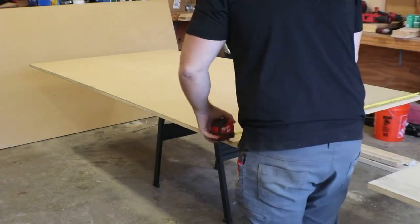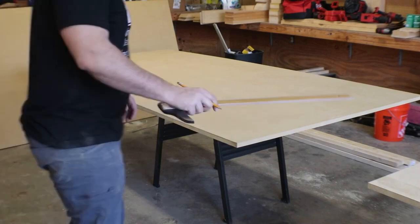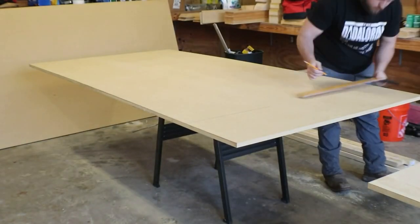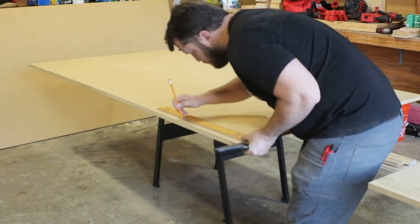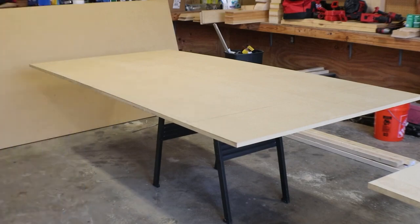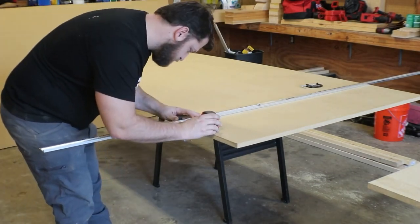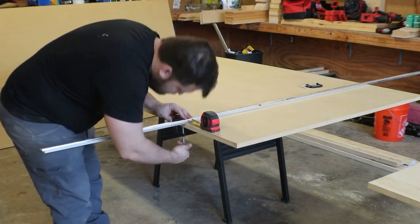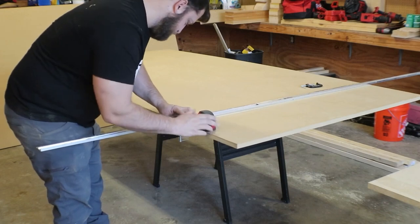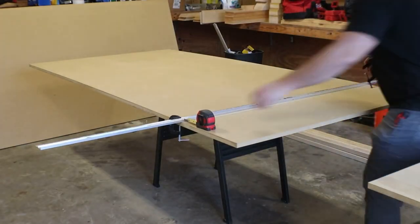Using standard Milwaukee tape measures — nothing fancy — and just tons of pencils so we can mark everything. Cutting these larger sheet goods can be difficult. We've got these pop-up DeWalt mobile workbenches — link in the description — they've been great for assembly tables and taking out to job sites. They're about a hundred bucks. As you can see here, we're strapping down that straight edge using standard C clamps to attach it to the table. It's not an actual track saw but you can make it work — you just have to accommodate for where the blade lands based on your skill saw's plate.